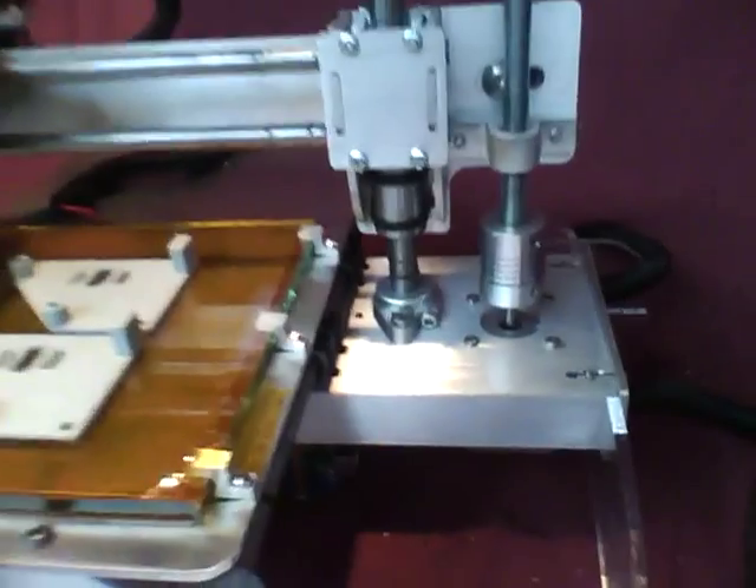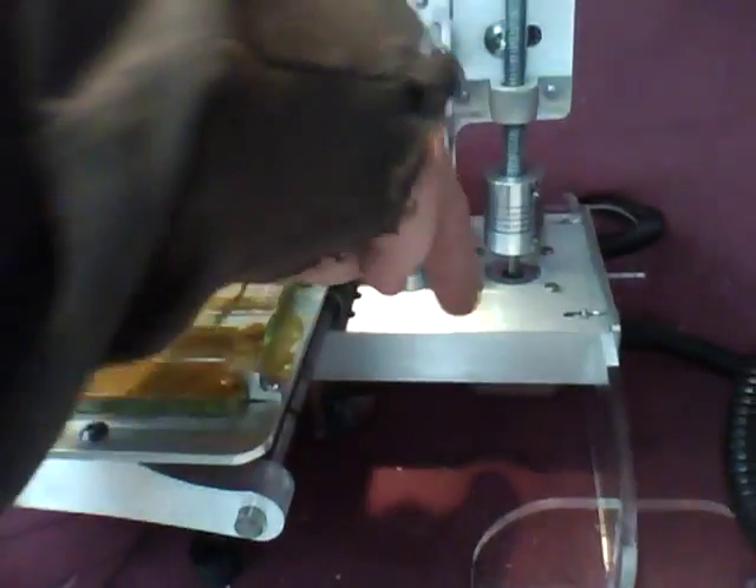Nothing is tabbed — I hate tabs. What I actually do is measure the thickness of my material really carefully at a lot of different places, and in essence I cut through the material a little shy — a few thousandths shy — and I just leave a little bitty edge all the way around my pieces. I found that a lot easier to deal with during final edge cleanup than it is to cut tabs off. So if you want tabs, add your own tabs.